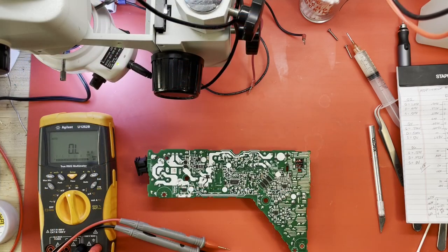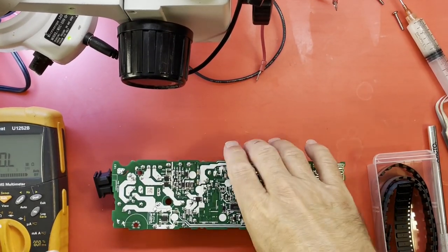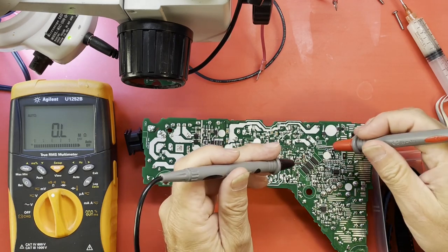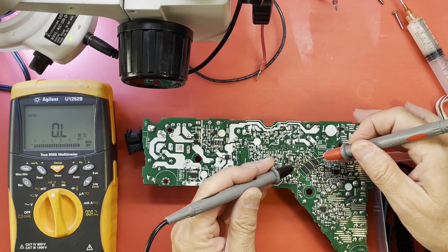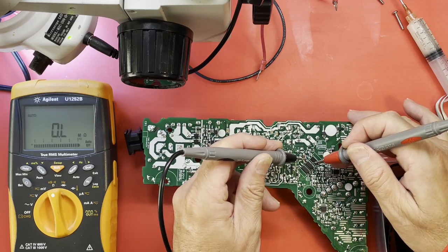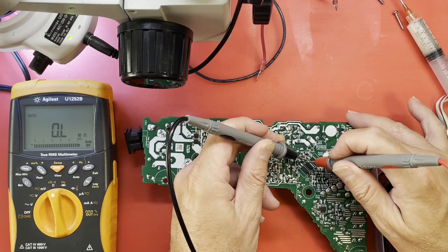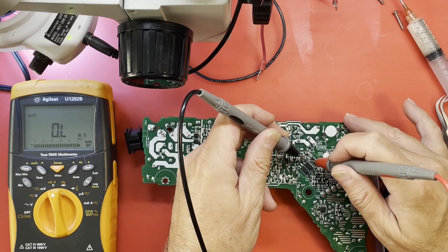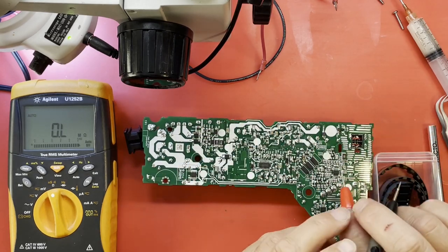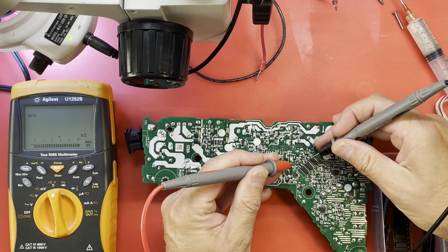Okay, I lifted pin 4 of that opto-isolator. See if we can zoom in a little maybe. And I read like 20 megohms. So pin 4 is lifted, so it's isolated. And if I go from, I think it's from here to here, it's varying around, which is kind of weird. Don't know why it's varying so much. I'll make sure that terminal is lifted.